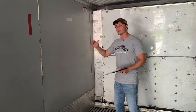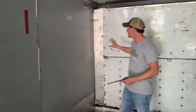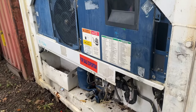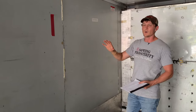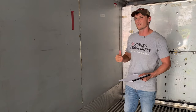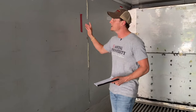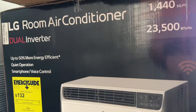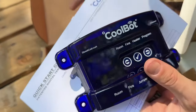This is the rear — the back of the 40-foot insulated shipping container — and this is where the refrigeration unit that doesn't work is. We've lost about a foot to two feet there. Our goal for this section is to get to about 38 degrees. We don't have a whole lot of produce at the market that needs that refrigeration level, so we're only going to come out to about eight feet, and we'll have the air conditioner unit hooked up to a regular CoolBot.